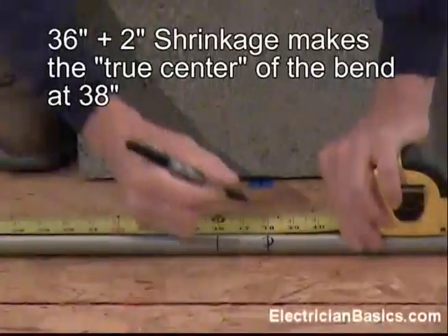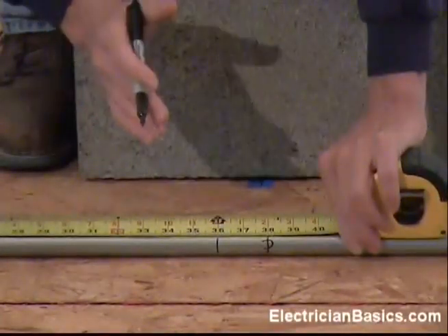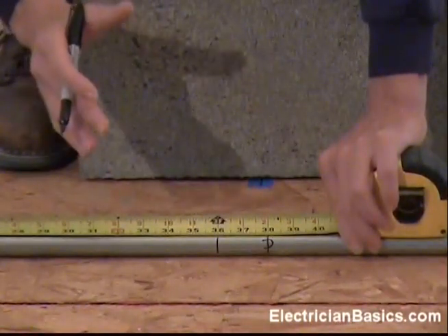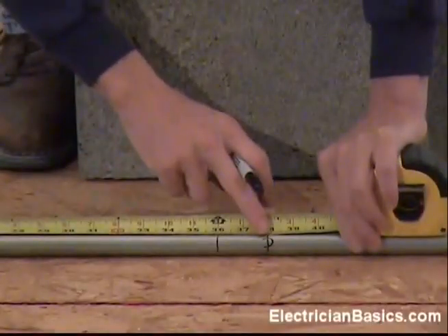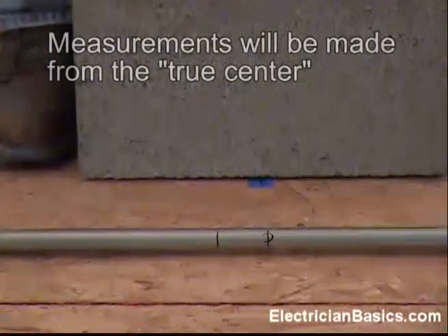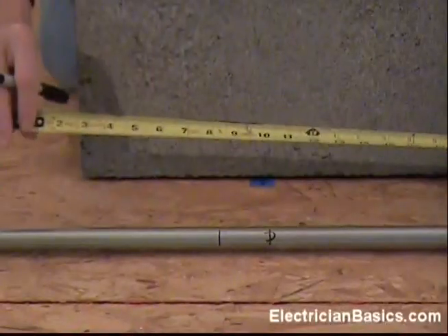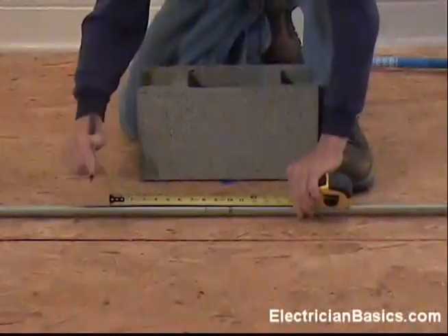The reason we add the 2 inches is that if it's going to shrink, we have to make it bigger to allow for the shrinkage. That's why we have to mark away from the fixed point, because it's going to shrink toward it. If something shrinks, you have to make it bigger if you want to keep the same result. So this center, where we have allowed for shrinkage, is where we will make our measurements from. The block is 16 inches wide; half of 16 is 8, and if we want to add 2 inches of clearance, we have to mark 10 inches away on each side.